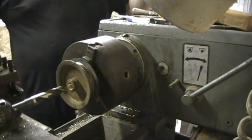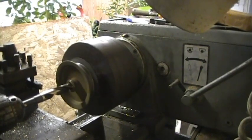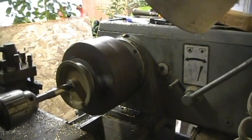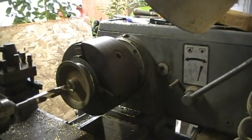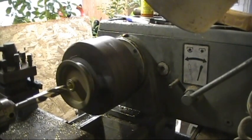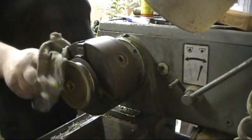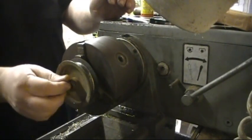Let's get this pulley done. I know that was too fast for a 5/8 bit — I should have slowed it down a little more. Two reasons: I wanted the heat to build up and make that bushing expand — it'll make it grip. When you drill brass like that, especially if you get it warm, it will expand and it will grab and it will make it stick in there better.